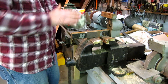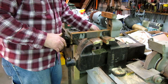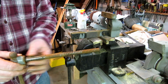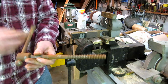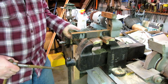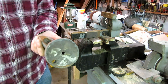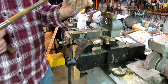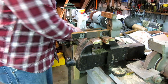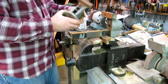So I have a couple of jobs to do. I have to flatten this off, flatten this, and wire brush the threads and the bar on this draw bar. Thread that in and it locks up everything. The threads in this vise are actually part of the casting. Sometimes it's a separate piece and that can come loose, but with it being part of the casting it's not replaceable. So if you ever screw up this casting, the vise is toast.